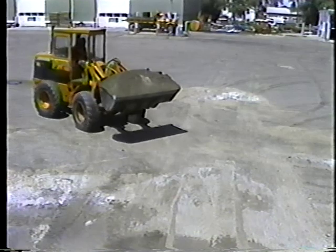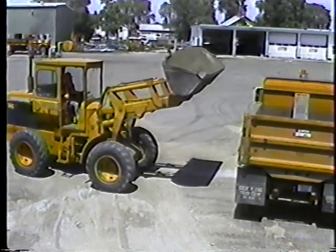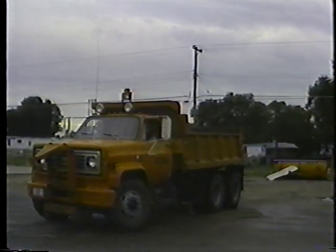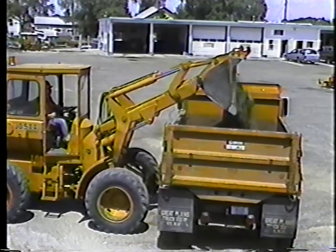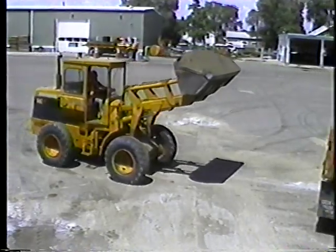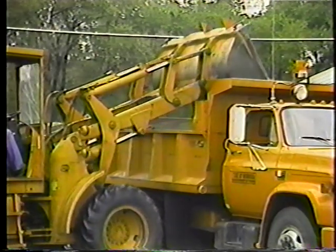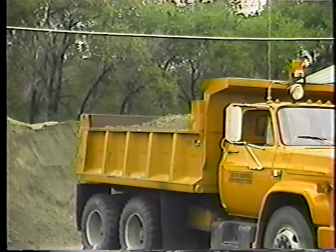When returning to the loading site, position your truck so the loader can go from the stockpile to the truck easily and quickly — look for tire tracks of other trucks, as that's probably where the loader operator wants you. While your truck is being loaded, be either in the cab or well away from the truck and loader. Don't let the loader operator overfill the box — driving an overloaded truck is against the law and the truck driver is responsible for any fines. The weight of the load must not exceed the legal limit, and the height must not exceed the sides of the box. If it does, have the loader operator strike off the excess or level it yourself with a shovel.